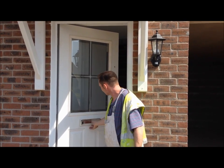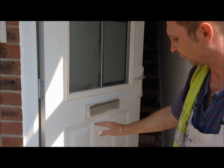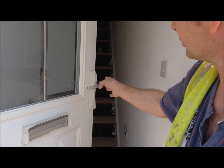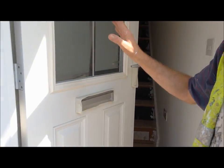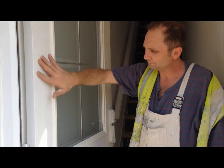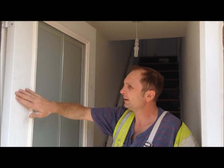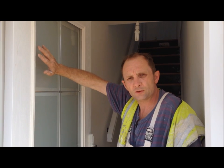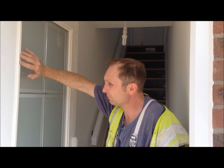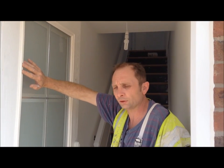As you can see, I've started off by masking the letterbox, the drip strip at the bottom, and the door handle. I've also gave it a light rub down, just to form a little bit of a key, and I'm going to start by undercoating this in a grey etching primer. Then I'm going to undercoat and gloss it.